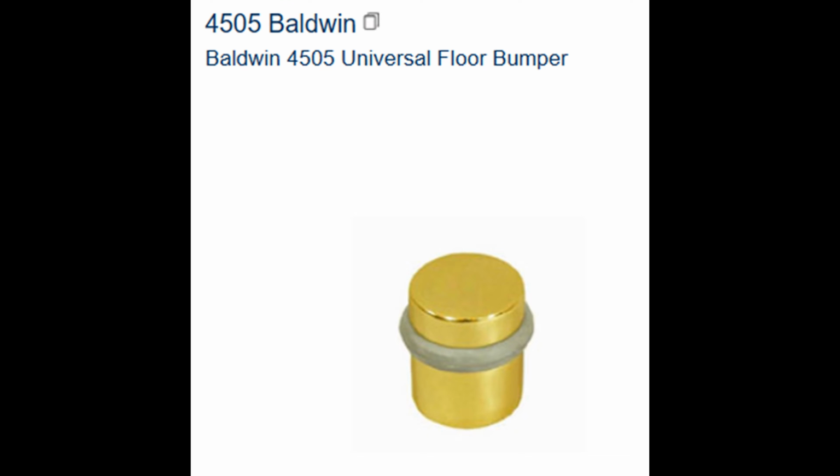Well, if it's sitting on tile? Yes. I don't see there being any way short of putting epoxy down and trying to glue it down and hoping that very, very little force is actually making contact with it. Force with the door, right? Yeah, there's no fastener that's going to really just bite into the tile, 3/8, let's say. You've really got nothing to go to.